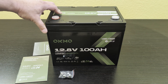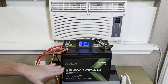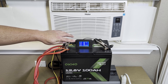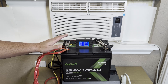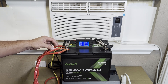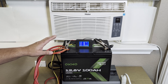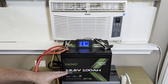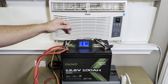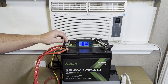I'm going to get this thing charged all the way up and do a capacity test on it. The battery is now fully charged — you can see it's got a resting voltage of about 13.9 volts, popping between 13.9 and 13.8, so it's at a good resting point. I've got three heavier gauge wires — I think these are sixes and an eight — going to the inverter to make sure there's enough wiring to power it properly without low voltage. I've got this battery monitor here to watch what's coming out of the battery, not what's coming out of the inverter to the AC unit — just the power coming out of the battery.